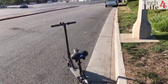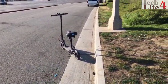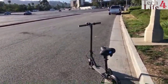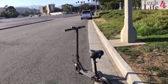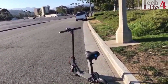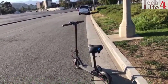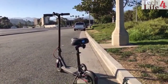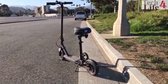And from what my research indicates, a good way to start, at least, is to use something called a Genasun lithium, and it's like a boost. It's an MPPT, that's maximum power point tracking. It tracks the voltage, the power fluctuations in the light hitting the solar panels 15 times per second, if I recall correctly. So that's very good, versus using some of the older technologies to charge batteries with solar panels. So I ordered one of those. I ordered a Genasun lithium.